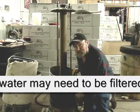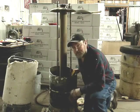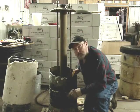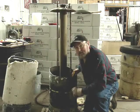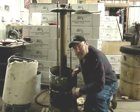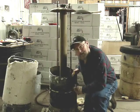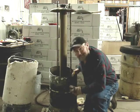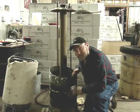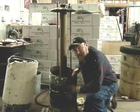Honestly, I'm surprised — there's not really much sediment in this heater. It's 15 years old, as I said previously, on a small town water supply. However, this is the reason that all tankless water heater manufacturers insist upon the water being filtered and/or softened before it enters the heater. Because tankless water heaters don't have a tank, they have no surface area internally to store deposits of sediment and iron and those things that are in untreated water.